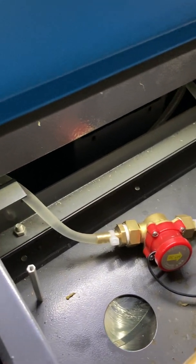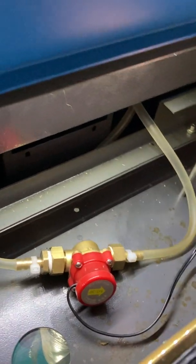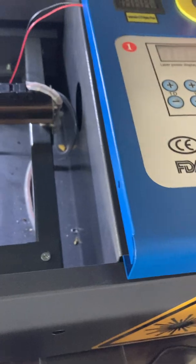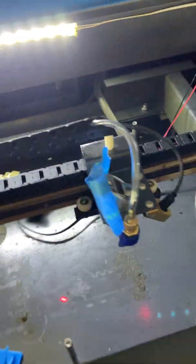I've got inlet water coming in — this is going to the laser tube. I made sure I don't have any bubbles. I've got this thing wired to the power supply over here. It's connected to the P and the G, and obviously I don't have the wiring routed permanently here. I'll properly route that once I test this.